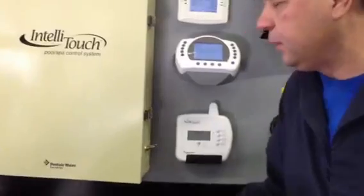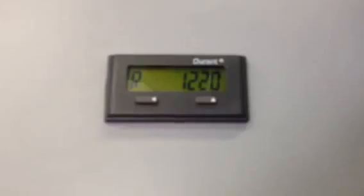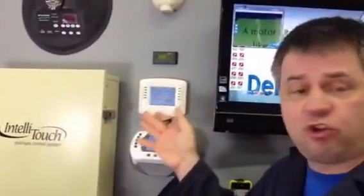Now, that's better for flow, for filtration, and in terms of power, when I hook my watt meter up to it, it'll kick in. It draws about 1,200 watts of power. So immediately what you'll see is that flow and watts don't drop in the same proportion. So we saw that we cut our flow in half, but our wattage only dropped by approximately 300 watts. So instead of 15 light bulbs running, 12 light bulbs are running. So it is a saving of magnitude, but there still are some efficiencies that we can find further to that.